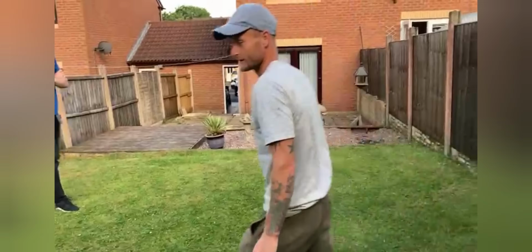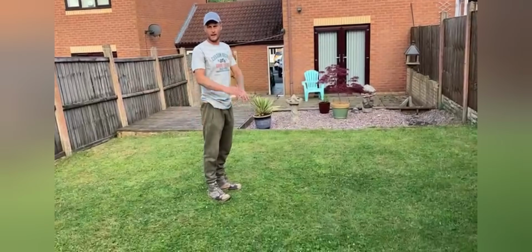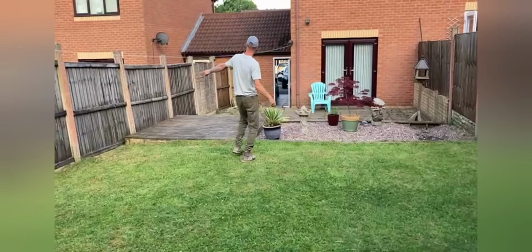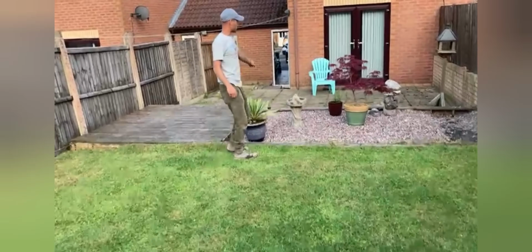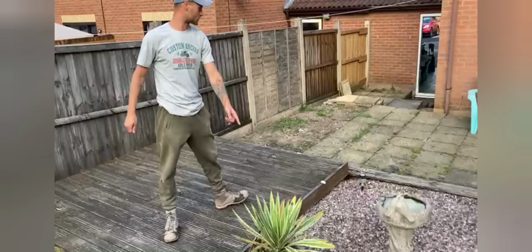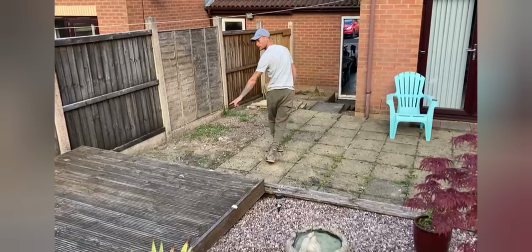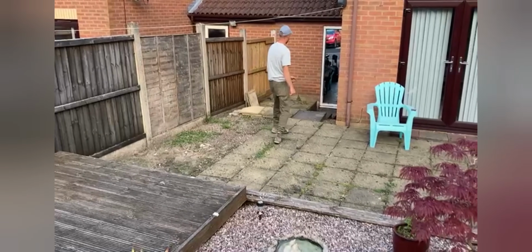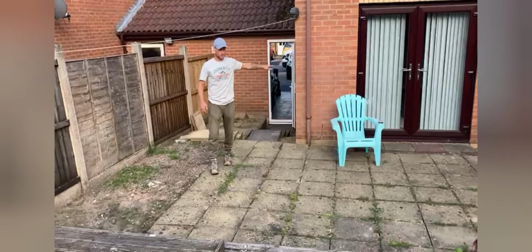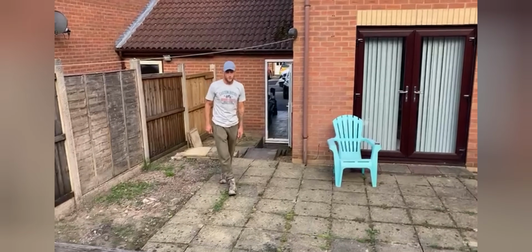So this is in the pipeline. We turf the whole of the back garden, dig out, soak away in the back there. This corner here, green range planters, dropping down to two steps there, extending the grass here another 1.3 out this way. Sleepers dropping down then, down to two, was it, Wayne? Yeah, to two, 1.2 out, and then he's having six steps all the way down there. And then he's having the whole patio area in Raj 2x2 Blend. So, stay tuned for that one.